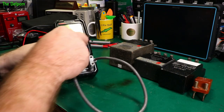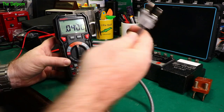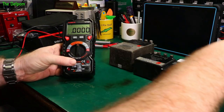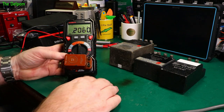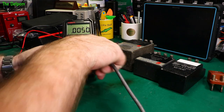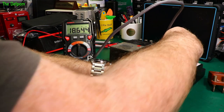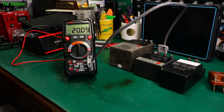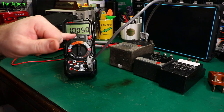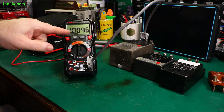Next is capacitance testing. It's flashing the indicators and there's 19mm spacing because of the plug-in. For the first one I want to use the capacitor directly. This is a 200 picofarad cap — reading 206pF, not too bad. 1 nanofarad reads 1.066nF — not bad. 20 nanofarad reads 20.9nF — very slightly high. 1 microfarad is looking pretty good.